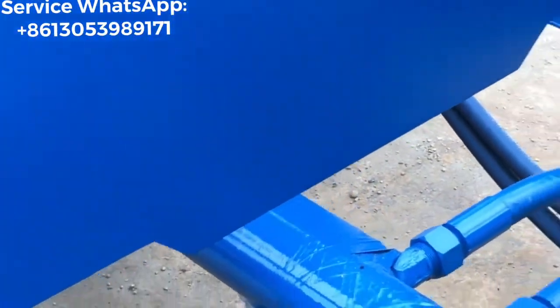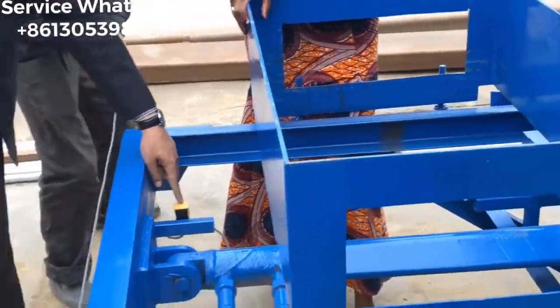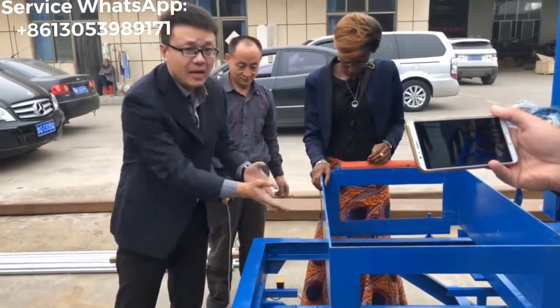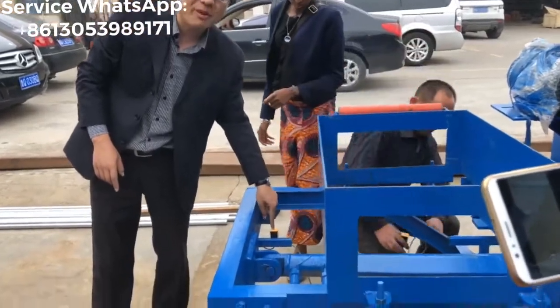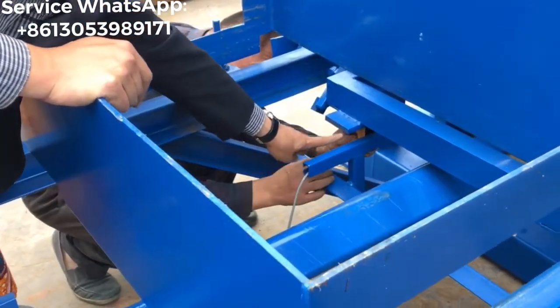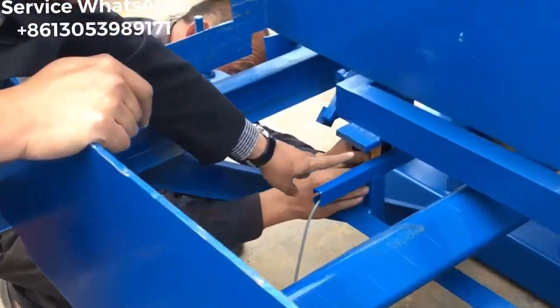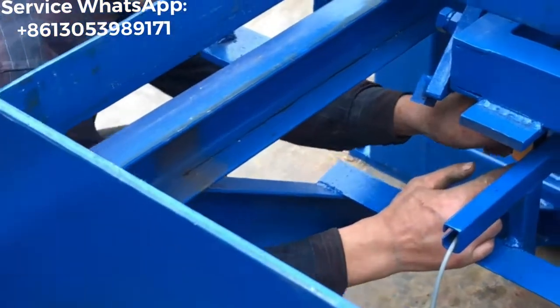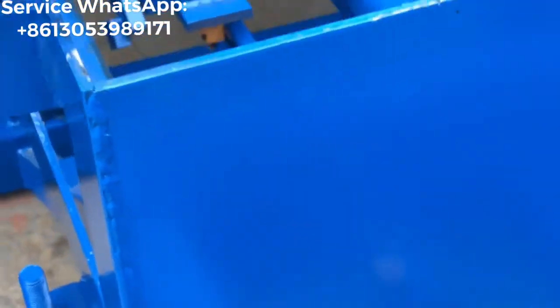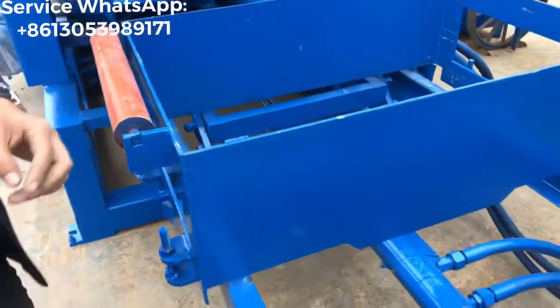And now, what have you seen? This sensor is for controlling the pellet feeder back location. This sensor is for the pellet feeder system. The pellet feeder system back location should be fixed here. And another sensor will be fixed over here under this part, right? Can you see inside? Can you see the down angle? From this position, you can see it. And this sensor fixed here is for controlling the pellet feeder system front location. Okay.